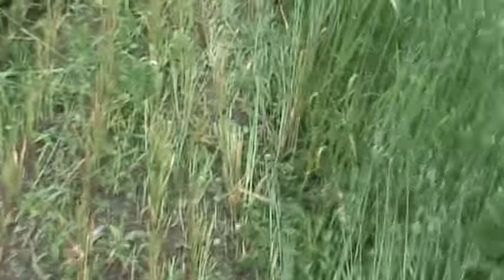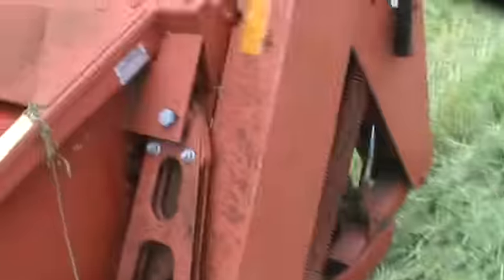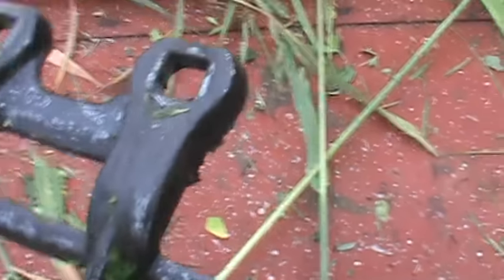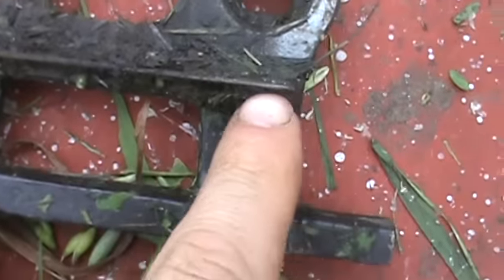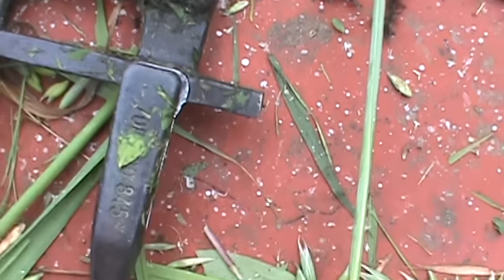The other part of this video is I have to go back and fix my haybine. I had a guard break off — a nut or whatever you want to call it. I actually found the guard. I thought it broke off but just by looking at it, I think the bolts themselves broke out. Somebody said realistically I should just go ahead and replace all the guards on here. Just by looking at the back here, you can see how it's worn out — it's pretty thin. So I have to go back and probably fix that.